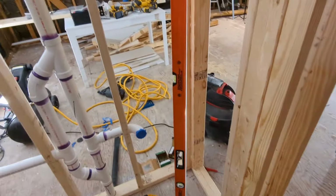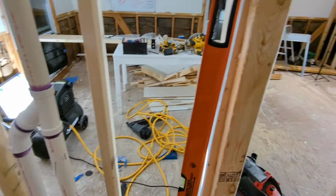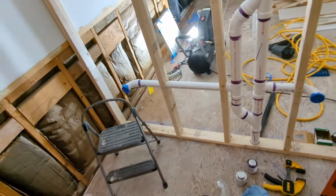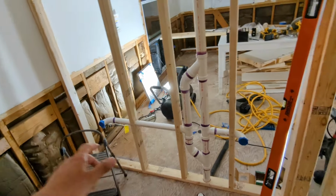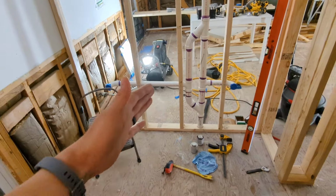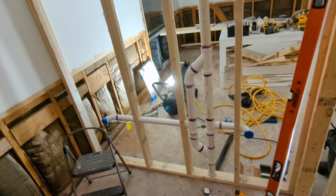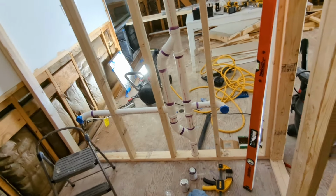This was designed so that once the drywall is on that wall, this whole depth should be 22 inches exactly, so that with the drywall here and the drywall here, my vanity, which I believe is also 22 inches, will be pretty much flush with the face of this wall. It's a 72-inch vanity, and I gave myself 72 and 1/8 inches between this drywall and that drywall, just to have a little bit of wiggle room. I think they actually taper the vanity, so the back is 1/10 of an inch less wide than the front, which helps you fit it in there. Anyway, I added 1/8 of an inch, which gives me maybe a 16th-inch gap on each side that will get silicone.